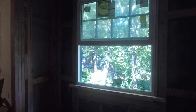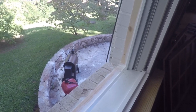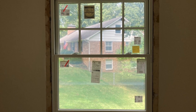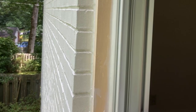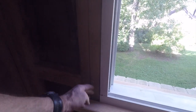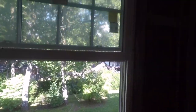The dry fit looked fantastic. After the dry fit, you pull the window out, then run about a three-eighths inch bead all along the inside of that frame, then pop it in and slide it in. The outside all around between the frame and window is nicely caulked. This is essentially the finished product — a beautiful flush mounted fit, ready for casing, caulked on the outside, sealed, and ready for paint once the caulk dries.